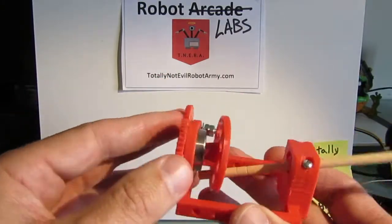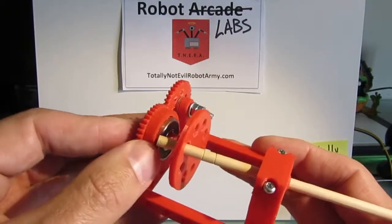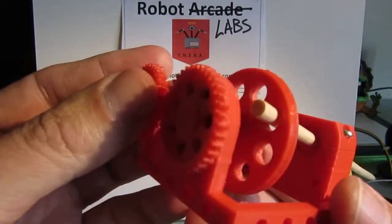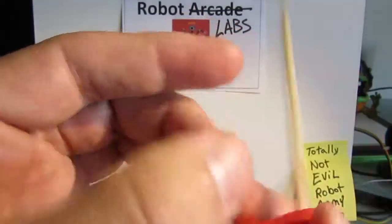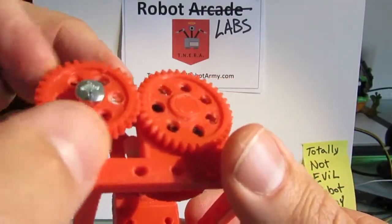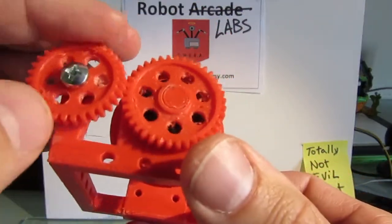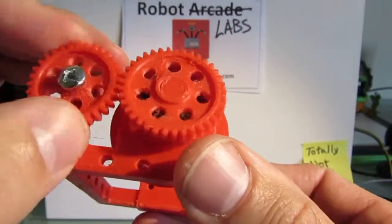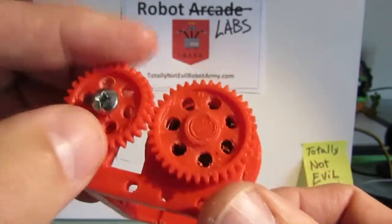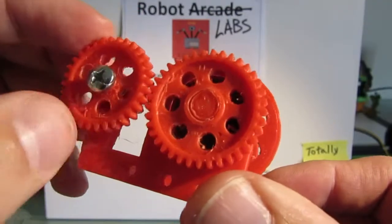But this is just a draft. As you can see here, the tolerance on the bearing leaves a lot to be desired, and the gears themselves — I've created a larger gear set here and this seems to be working, but I would probably go to a little bit larger gear, larger teeth, lower numbers of teeth, but larger gears, because I don't think we need to have quite this many.